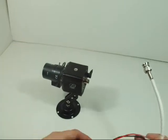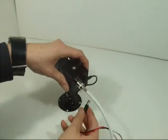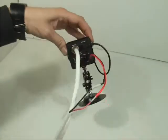You can also use a pigtail on the power side of the Siamese cable to make a power end. Now you have both a BNC video end and a power end for an easy camera connection.